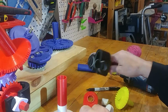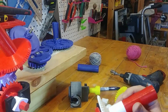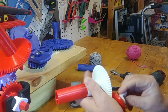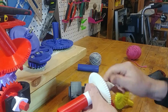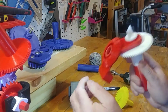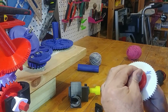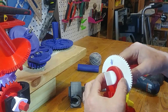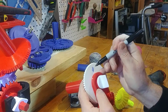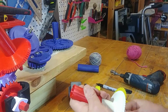First thing I do is actually start working with the gear 2 and the large gear. Once you're in the final assembly of this, you're not able to feel how tight it is, so I set this up ahead of time. You turn in the screw, and you'll feel it. This doesn't move, and you slacken off a little bit, and it just goes nicely round. Once you're comfortable, you've got the right level of tightness, I mark on the screw here, and on the large gear, exactly where they are. That's for a later stage.